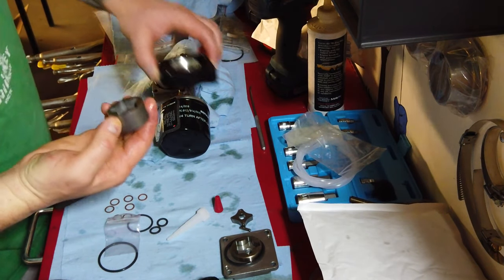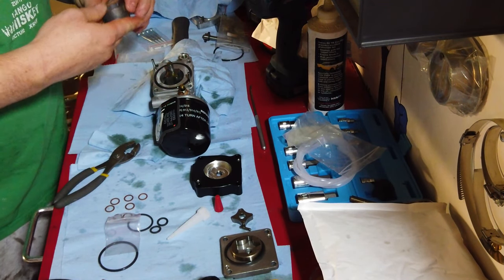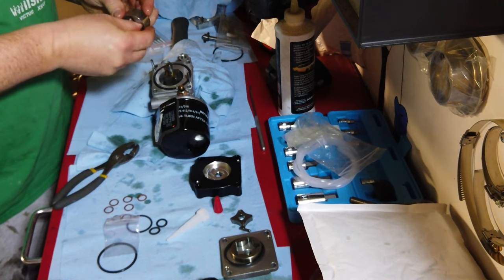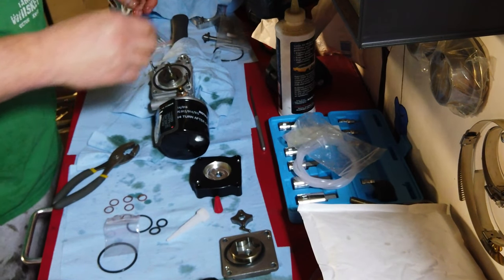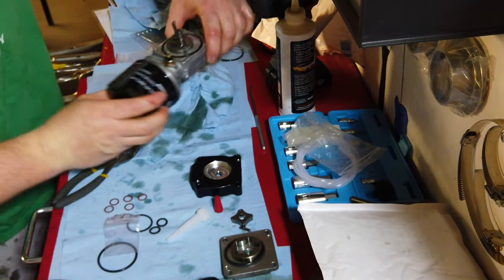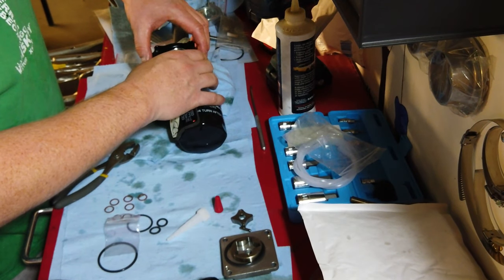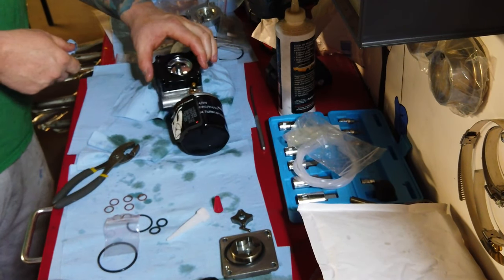We've got to put this in — we took note that the marked one goes down because the underside of the gear is marked. Drop some oil on the inside and outside of this, work it in real good. There's the mark — there it goes, that's in there, very good. Like I said, this is all sticking up a little bit because it is taller, but it fits into the recess in the housing — the housing was obviously machined to fit that just right. Feels like a really nice fit — goes together right, nice, didn't have to force it. Still a little stiffer than the old one but that's to be expected when it's new and fresh.